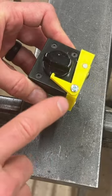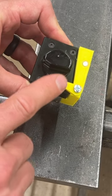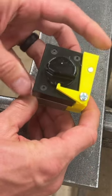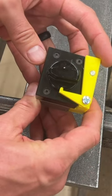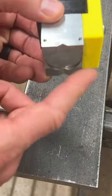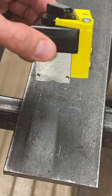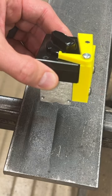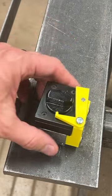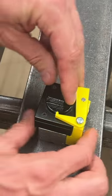The thing I'm doing with this project is adding a latch to an auto-on MagSwitch magnet. This is a technology you probably haven't seen yet. The latch holds it in the off position. Releasing the latch puts it in standby mode, which gives it a weak magnetic field so you can place it against a metal without it banging, but once you do this, the magnet automatically turns on. Can you think of any applications where this would be good?